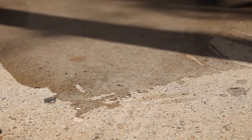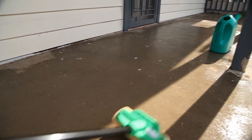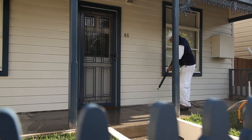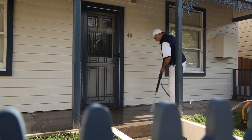Here's a tip. If the concrete etcher doesn't foam, you might have an old clear coating or some kind of surface contamination. If there's a clear coating, you need to scrape or sand before etching again. Give the surface another good scrub with the broom and rinse the surface with a strong water jet from your garden hose to remove excess etcher, salts or any other residues.